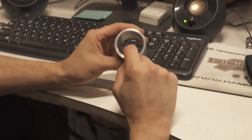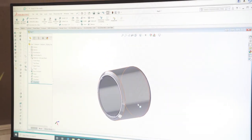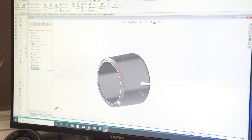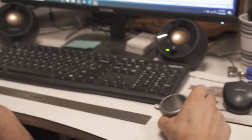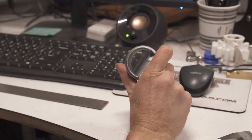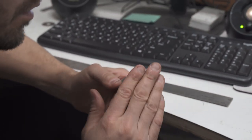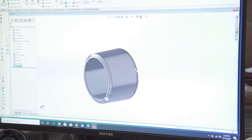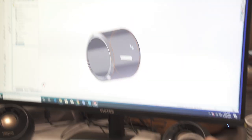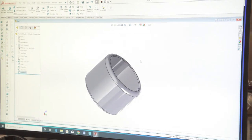This part we're not getting laser cut — we're going to make this on the lathe. I'm actually going to use this part, so it's only as good as you are on the lathe. This started as a piece of DOM tubing. The inside diameter was a little snug, so I had to use a boring bar to take a little more out of the inside, then I rounded the outside off with a grinder while it was spinning on the lathe. It didn't take too much work, but if you didn't have a piece of tubing you could start with a solid chunk of steel.